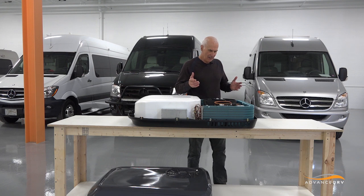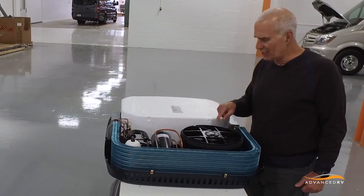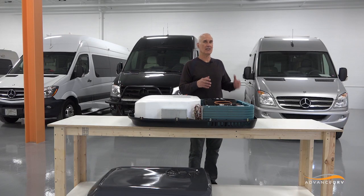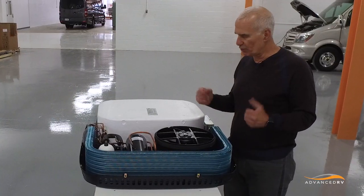If you look closely, these are steel fans that are precision manufactured. When we first opened this up, we looked at the fan — the bearings are amazing, it's very free-flowing. The fan is balanced; there are little metal clips placed on this fan to balance the blade. If anybody has ever balanced an airplane prop or balanced an engine, you know how that reduces vibration and improves performance.